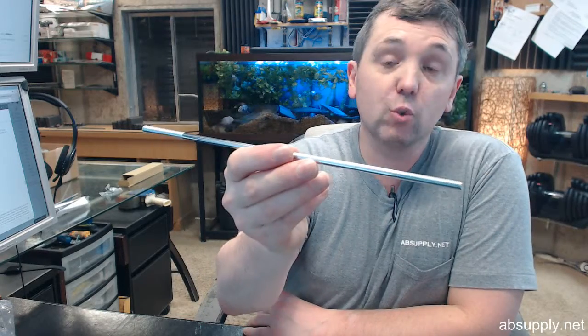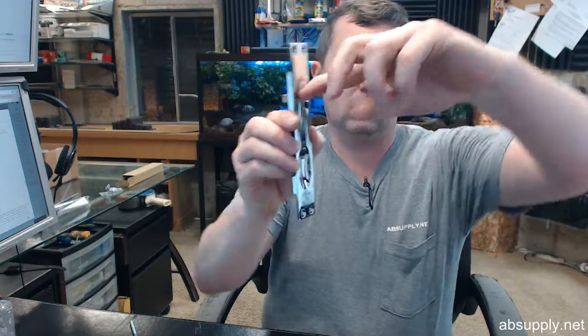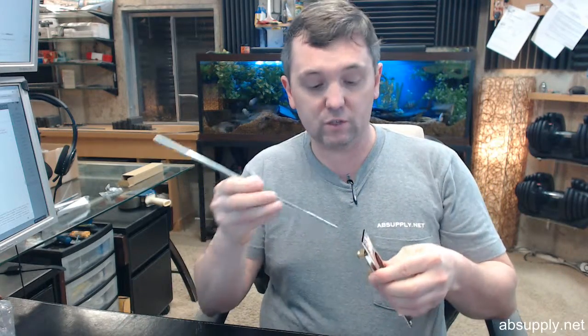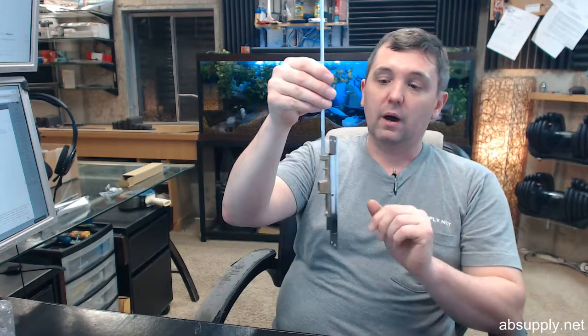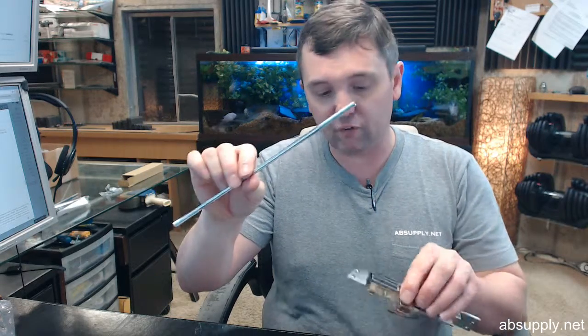Now, the rest of the components that go with a typical extension flush bolt will be, of course, the rod, and this is inherently a 12-inch lever extension flush bolt. The dimension of 12 inch is referred to the top of the door to the center of the faceplate. So this rod, which is 1/4 by the way, will achieve 12 inch to the center line. Should you need 18 inch, 24 inch, 36 inch, any size, DCI can accommodate. They're going to swap out that rod for a different length rod.